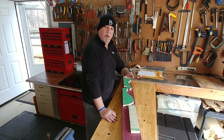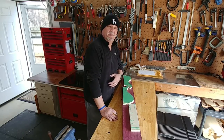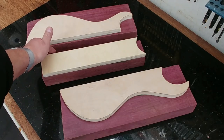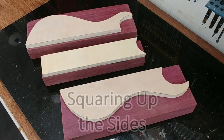We'll trace these out, cut them on individual sections on the bandsaw, then put them on a planer and mill them to the exact thickness of the neck tongue. Then we'll shape the sides and we'll be ready for a glue-up — but there's a little trick in between that I'm going to show you. I've cut each Purple Heart blank to size for the template to be laid on top, traced out, and cut out. Next, I'm taking each block and putting the adjoining faces through a jointer-planer to make sure they end up flat and square so they'll glue up properly.